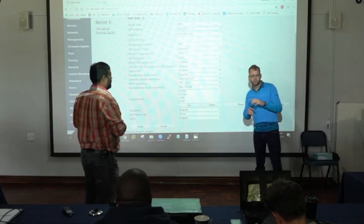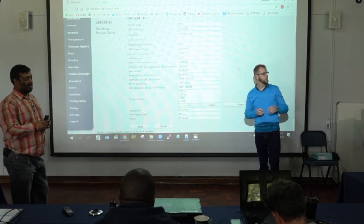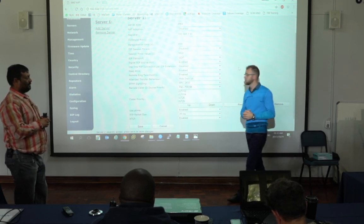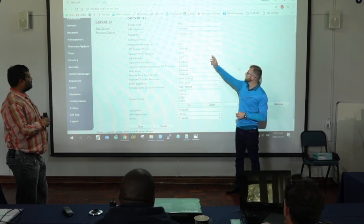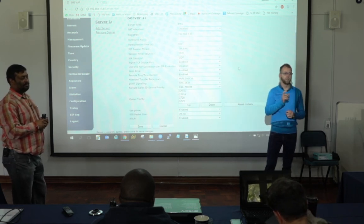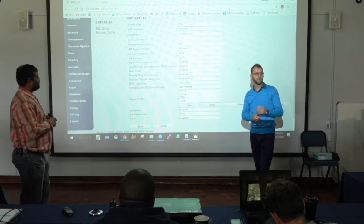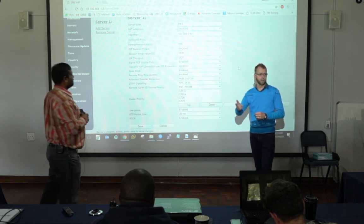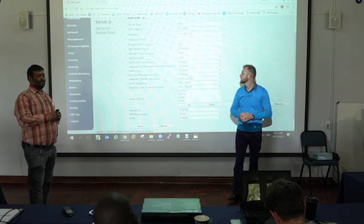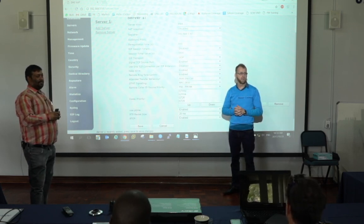Okay, so the solution we sell mainly is the hosted solution, not when there's a PABX involved. But today's setup, we're doing it on a PABX. With the hosted solution, the registrar address will be the client's name. We have pre-configured a bunch of domain names on the hosted PABX, for example abcshoes.scm.com. Whoever worked on the SCM before will know what I'm talking about with the domain name. The outbound proxy in the hosted solution will be the PABX's public IP address.